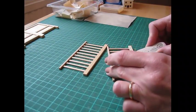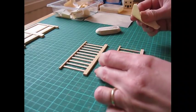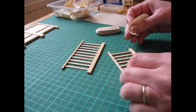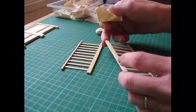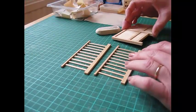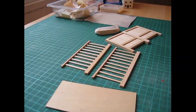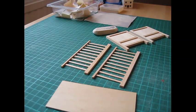Once the glue is completely dry, very carefully erase the pencil marks. Then use your fine grade sandpaper to sand the piece to prepare for paint — keep the piece on your work surface as you do that, and you can do it on both sides as well. This flat edge will become the inside edge of the cot. Because of how it's constructed I find it easier to paint before final construction, so paint your side pieces, end pieces, and base. We'll paint the end tops once they're fitted and give the whole thing a second coat of paint once it's constructed.